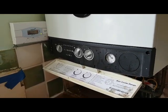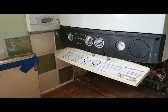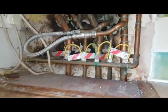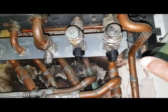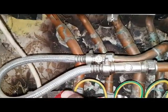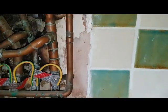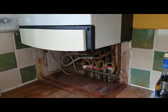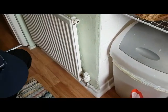It sounds like indigestion — got a bad stomach. So it's drastically overheating. There are a couple of things this could be. Let's have a look underneath here. First thing, we'll just make sure the valves are open — this is the return and that's the flow, they're both open. Now let's feel the pipes to see what's going on. That one's steaming hot and the return is hot too, so it is circulating. Next thing — what do you think we need to do? Check the radiators. Let's go and do that — check the radiators are open. So we found one that's shut — let's see if there are any more.